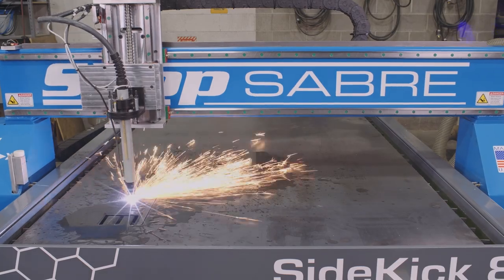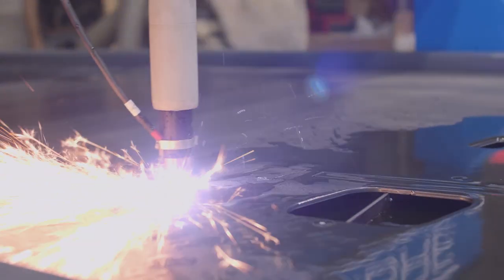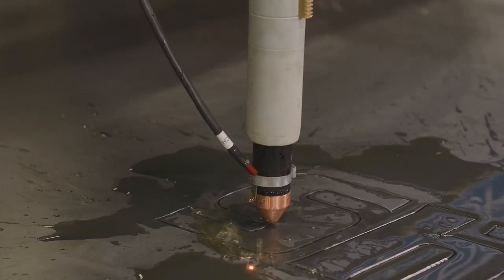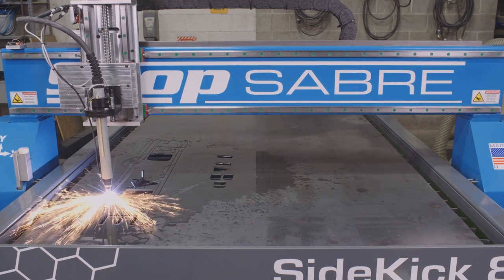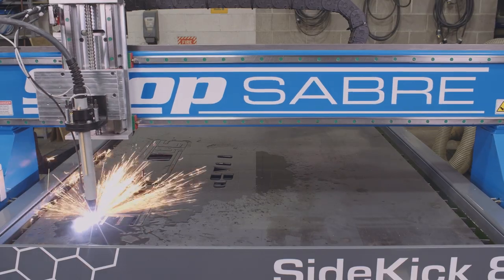Because of this acceleration, you achieve better cut quality, and because you have less heat effect, you get tighter hole tolerances and reduced part cleanup. Ultimately, if you can maintain the optimal cutting speed longer, you will get better overall performance — and that means more accurate part shapes, better holes, and tighter corners.